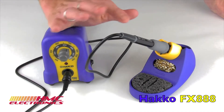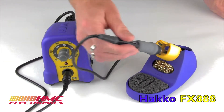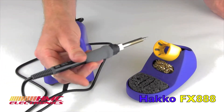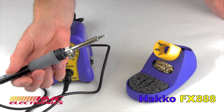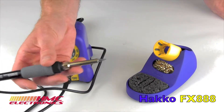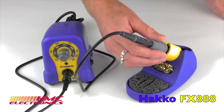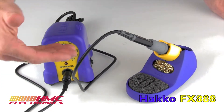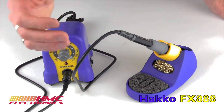Going back to the power of this unit, the 65 watt pencil — what's really quite impressive about this unit is its temperature stability, plus or minus 1.8 degrees Fahrenheit. The closed-loop sensor is what keeps it controlled, keeps it at that sort of constant state.